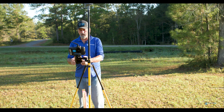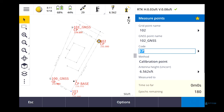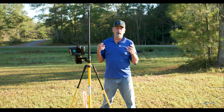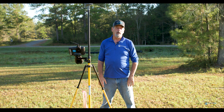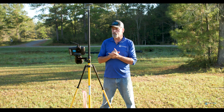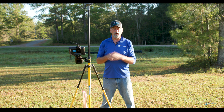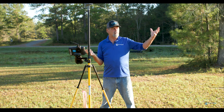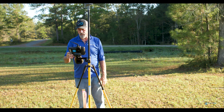Okay, so let's shoot in 102 real quick. Enter, measure. Same thing, we're going to do 30 epochs on here, and then move up to the next one. The last one we may stake out to see where we're at. Then I'll show you the other points that I've calced up and explain what and why I did it, probably in the shade somewhere, where there's not this blistering glare on me. Okay, close enough.